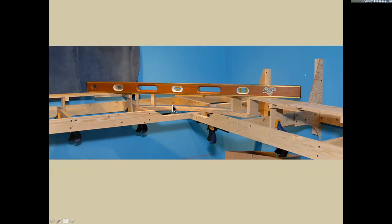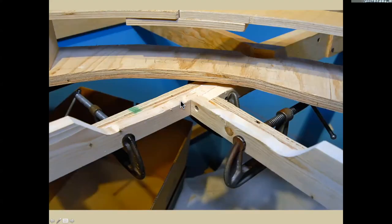And in this corner of the layout, this is a bridge position, and I wanted the ground to be somewhat lower there, so we cut away part of the framework that supports the upper deck framework in order to drop the scenery down a little bit. And because we're cutting that away and trimming down on the size of the benchwork, we have some 3/4-inch plywood braces that are glued to the inside and reinforced, which works out really well. Hasn't had anything fail yet, but then I haven't had any 400-pound friends come over and put their elbow on it yet either.